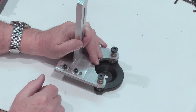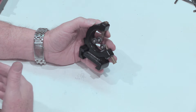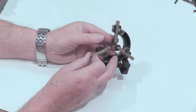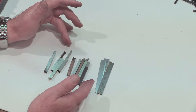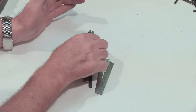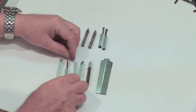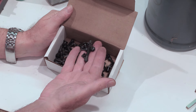This is the steady rest for the lathe, and I've modified it by adding ball bearings to the ends of the fingers. It originally comes with brass or bronze pieces that just rub against the work piece and make a mess, so by adding ball bearings I've made this tool a whole lot more usable. These are the cutting tools I'm supplying for the lathe — most of them are high speed steel with a whole variety in here. One is for cutting threads with the threading attachment for outer threads, and two others are for cutting internal threads. The rest are your standard left and right hand cutting tools, and there are a number of cutoff blades as well.